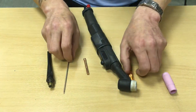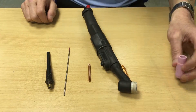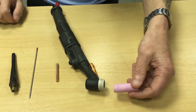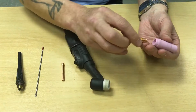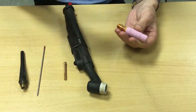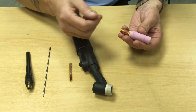These are the various parts of a TIG torch. It starts with the shroud. The shroud is generally the last piece to go on, and what that does is as the gas comes through the diffuser — which is this part — it comes out and covers your tungsten, stopping your tungsten getting dirty or burnt. It also protects your weld.